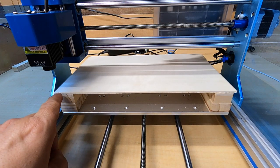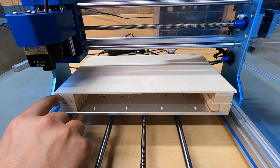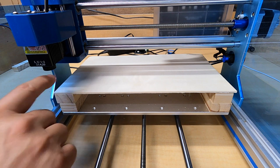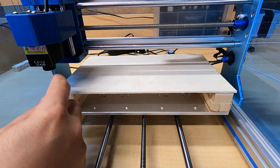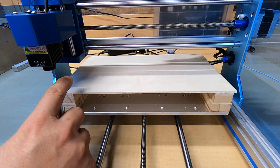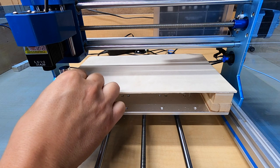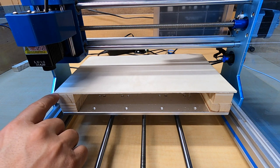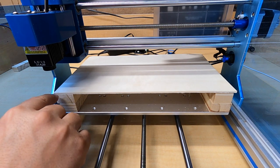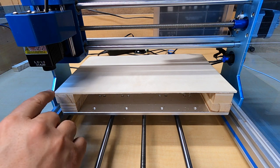I went ahead and focused the laser — there's a little tiny dot in the corner so I know my laser is fired. I fired it at 10% and changed the focal length to about 50 millimeters. I used my 40mm block, then changed my settings in LightBurn to a 10mm move — pressing that once brings me to about 50 millimeters. I adjusted a little bit and you can see a tiny dot, so I know I'm as focused as I can be.